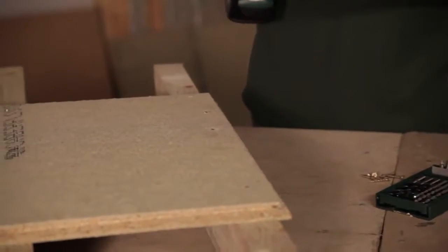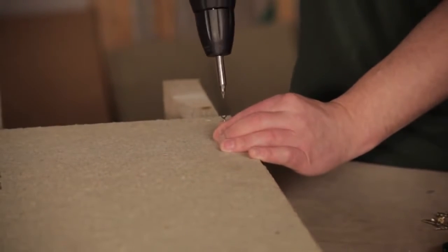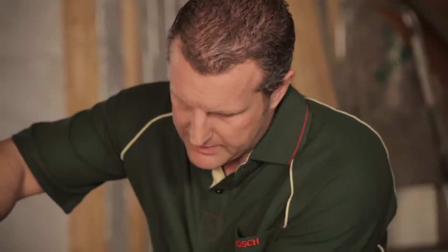I've got a piece of loft board, and what I'm going to do is show you the loft board going down onto the actual rafters — we're going to screw it down onto the rafters. I've set the drill on its lowest torque setting, put the screw in, and then screw into the timber and down into the joist.